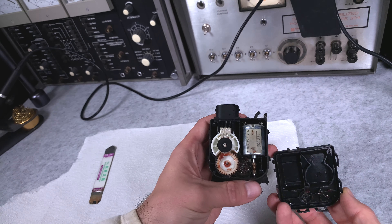From my experience with two-way radios I made the assumption that it's going to have exactly the same internal components, and that the end number is just a minor difference in the mounting. I hadn't tried to open it yet, but maybe I would be able to source that potentiometer from it. The reason we're going with that route is because that part costs 10% of this one - it's very common, you can buy it easily. If the resistor happens to be exactly the same, we're going to have a great fix at one tenth of the price.